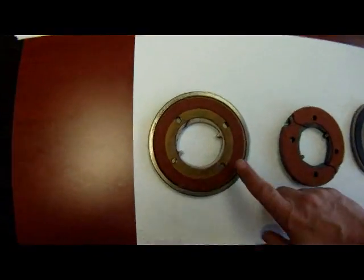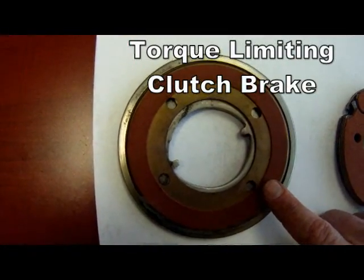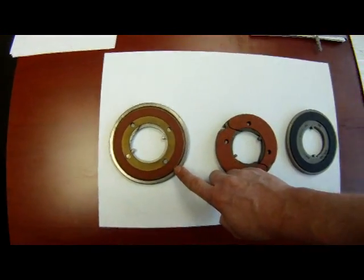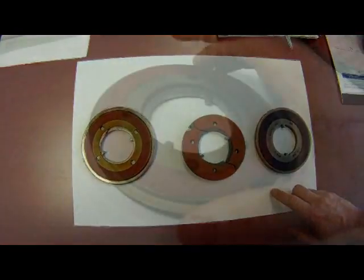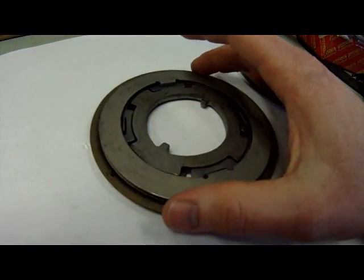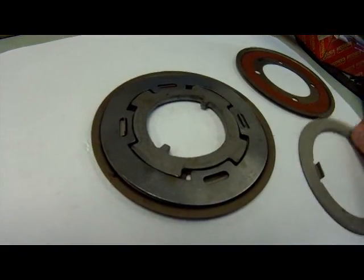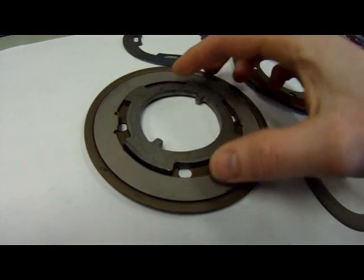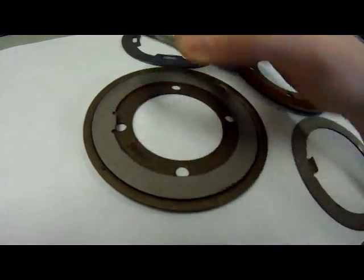The third is Ace's torque-limiting clutch brake. It has the same characteristics as the others; however, it is designed to ensure proper internal slipping and therefore is more forgiving to harsh conditions like improper installation. This design applies the same amount of braking torque no matter how much it is squeezed. Please keep in mind that other conditions like riding the clutch could cause premature failure.